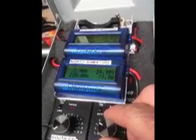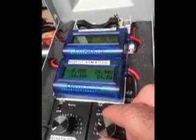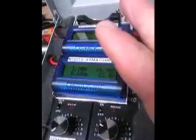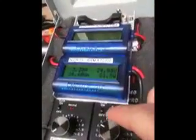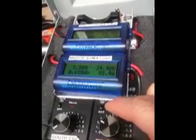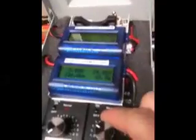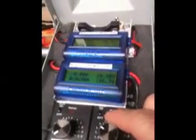You can see it's increasing — 2.3, 2.9, 3.31 — my hands are off. See, it's stabilized at 3.3. I'm going to increase the RPM again. Now it's 3.75 amps, making about 302 volts. Keep on going — it's now about 4 amps.